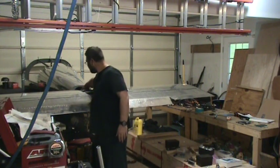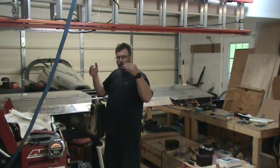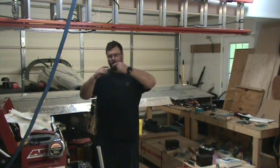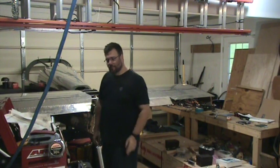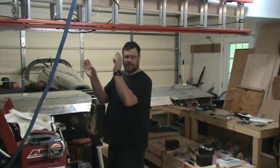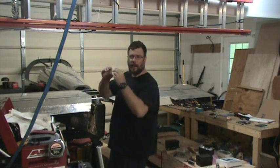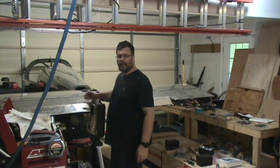So I'm wondering if I adjusted up here incorrectly, and those clevises need to be screwed in, basically effectively shortening the cable and causing it to retract just that little bit more, might give me that, or a mounting plate. I wonder if it needs to be turned in one more revolution to kind of move everything forward just that little bit more. Right now, it said to center that on the threaded portion, and I have 8 threads on one side and 9 threads on the other, is basically what it is. And so, actually, I got that backwards. The nut or the bracket would have to be spun out one time, and that would shorten it. And that would put 8 threads on the back end here and 9 threads on the front end here.